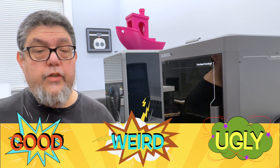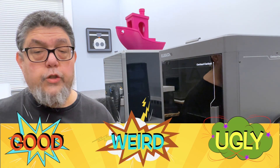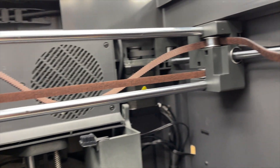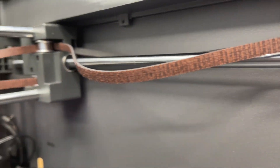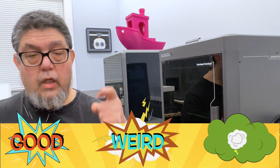As shipped, the entire printer itself was pre-assembled. Unfortunately, there appeared to have been no quality control on the first unit I received. The belts powering the printhead were completely loose — something that had to have been the case at the factory and couldn't have occurred due to shipping. That earns the printer its first ugly.